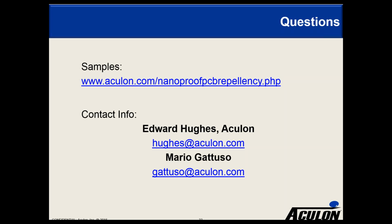Okay, next question is, do these various products have low boiling points? We'd need a definition of low, but I would venture to say no. What temperature would they consider low? Maybe we could, can you give a range of the various boiling points, Josh? That might be helpful. Yeah, so for the 1.0, 3.5, and 4.0, the solvent boiling point is 90 to 110, C or F? Centigrade. I speak centigrade. For 5.0, depending on which application you're looking to do, dip, spray, or dispense, the solvent blend is probably going to boil somewhere between 85 and 140 degrees C.